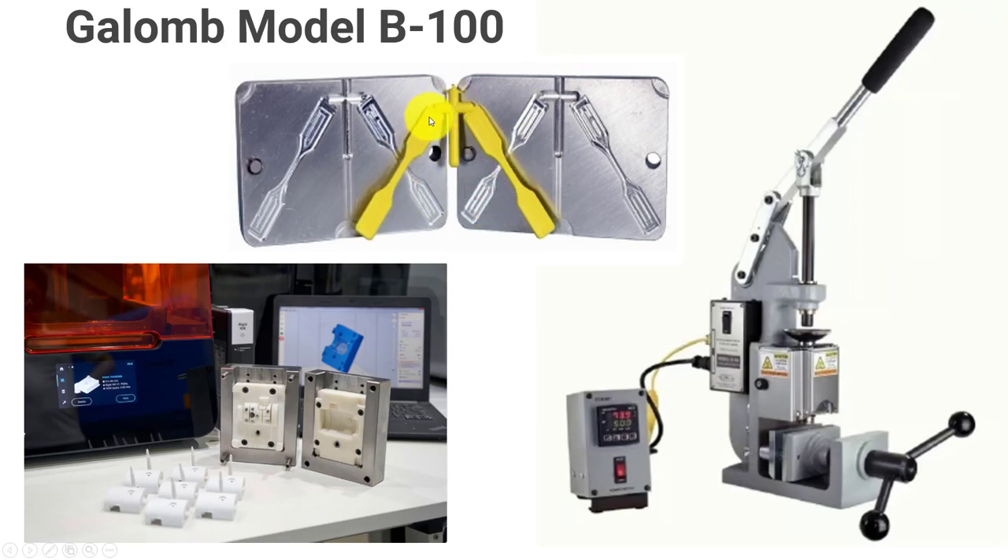We're not going to use yellow plastic; we'll use neutral colors and clear colored plastics for this lab. We would just recycle the runner piece or pitch it in the trash, as we do with most plastics unfortunately. These dies have dowel pins that locate and hold them together, and we want to make sure we're using the matched set. We have a couple of dies and each is a matched set — we can't interchange components from one die to the next.